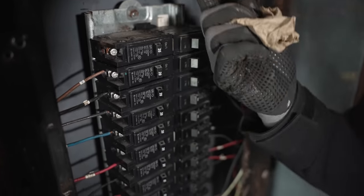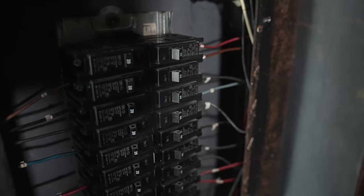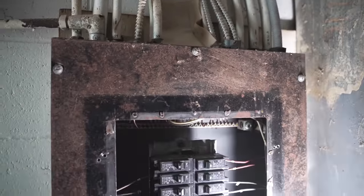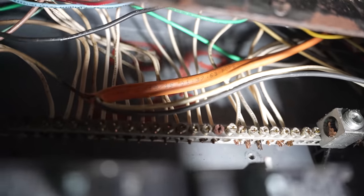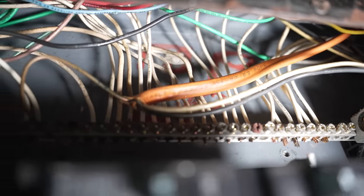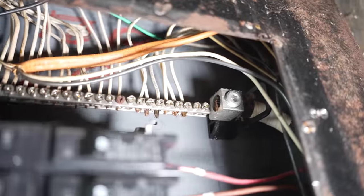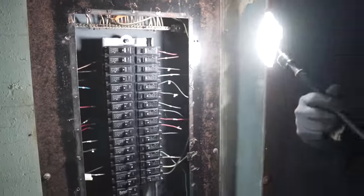Okay, we'll take a look inside. You're gonna like the little craftsmanship. You see the conduits are entering top and bottom of this panel tub, and so they really didn't have much opportunity for how to replace the tub in a cost-effective manner. You kinda have to cut all the conduits way back, set a trough top and bottom, but this was a creative solution, and I feel like whoever did it put some care into it. So I got some casual admiration for what's been done here.